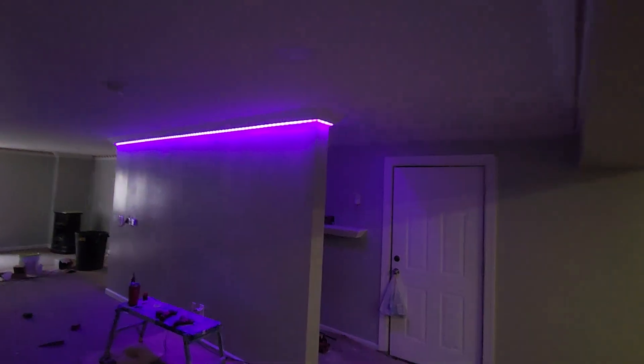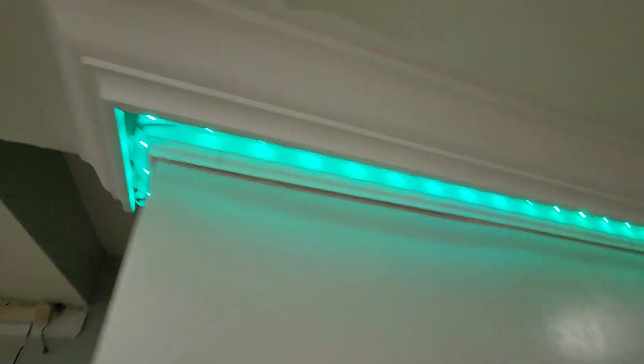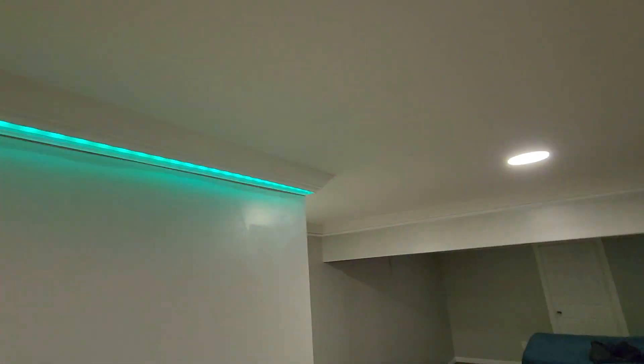When it comes to actually cutting crown, I know everyone does it different. I just hate seeing corners that are really badly done. So what I've done here is, these are done on a jig and then they're PVA glued together with a backer in the back to add strength. And you see a patch of mud there — that corner and that corner. Glued on the floor and then put up in place, so you get super tight corners.